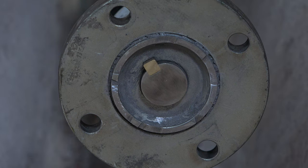Alright, so here I'm at it again, getting ready to install my engine back into the engine bay. I got lucky. I thought I had to change my engine mounts, mounting brackets, but it turned out that after I removed my drive shaft, I noticed that the part that was milled out for the Woodruff key actually went further aft towards the end of the shaft, so to speak. And well, it was just about an inch.